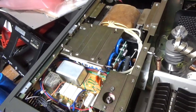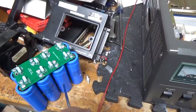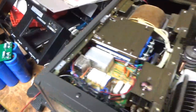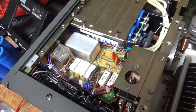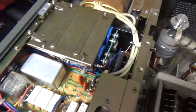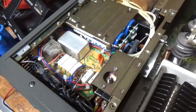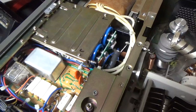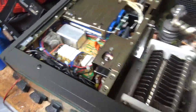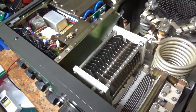As I said before, someone had put the caps in backwards and the protection diodes on half of them were shorted — diodes were also shorted on one string of the rectifier board. So the rectifier board has been changed, the whole assembly cleaned up, wiring zip-tied nicely, solder joints touched up, the series glitch resistor installed, the meter protection diode installed, everything secured really well. I checked the air variable caps — no arcing when I went to test it.